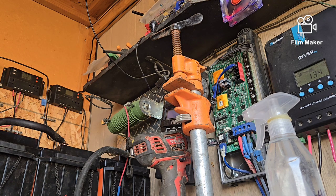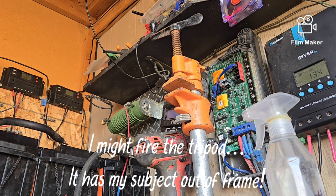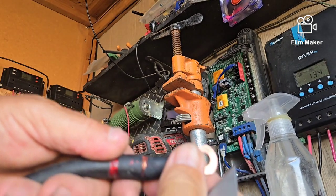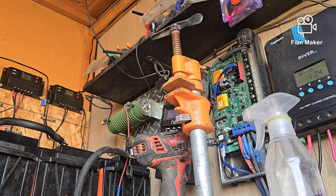It got so hot from a loose connection that the shrink tube melted onto the unit. Look at that — I can almost pull that wire right out of there. This one's really loose too. Yeah, look at this, it wants to pull right out of there. That's the problem — that's what's been setting up high resistance and lowering my battery voltages.